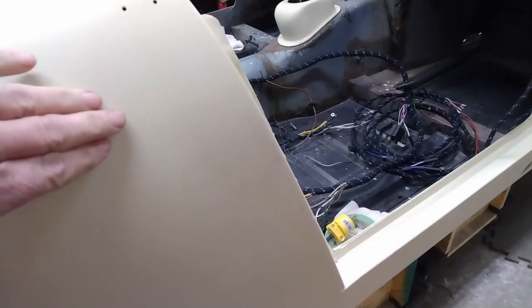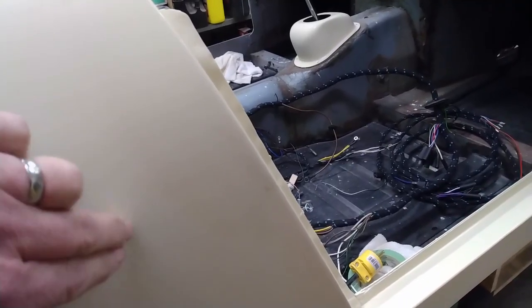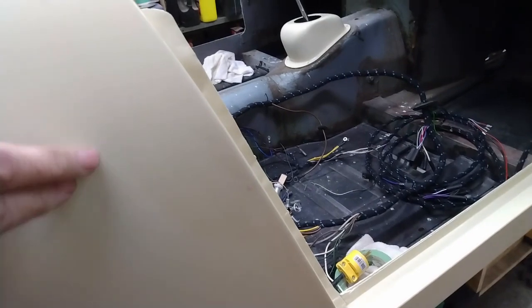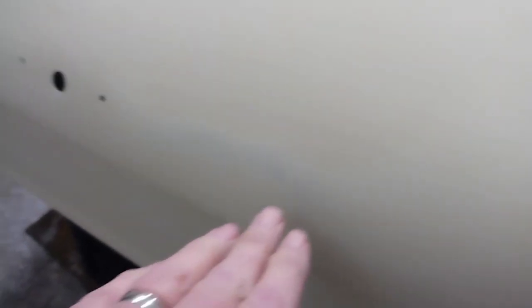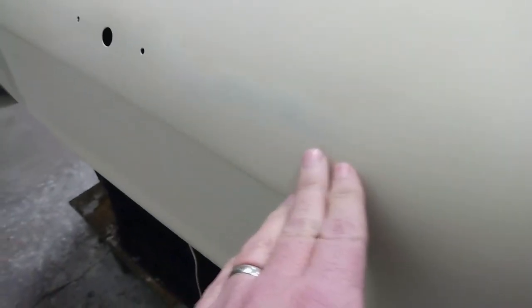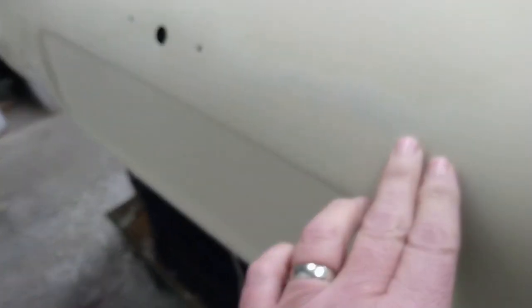I've got started down in here and I'll go up to here and then get the stuff at the front. It's a bit hard to see on camera, but it turns out that the paint I had put in the can was just slightly darker than the finish here, so it shows up. There's a line right about here on that spot. There's a dark spot here and there was a dark spot here, and then I kind of messed things up even further by sanding it - tried to sand it down too much and you can see the primer just showing through here.